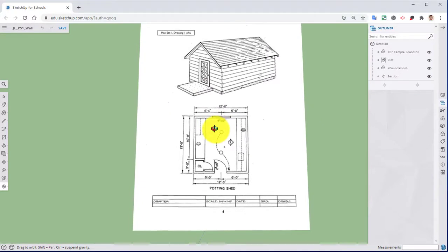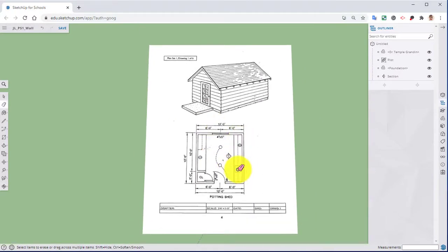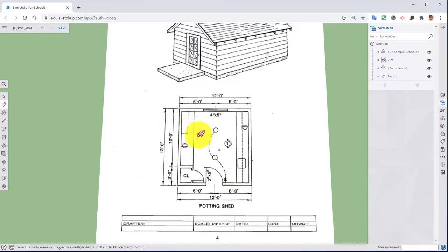This is drawing 1 of our Harley blueprint series, and this is what we are actually going to be drawing. So this is what it will look like. This is the overall layout for the walls. The overall width is 12 feet. The length is 13 feet. We have a small little closet, and then we have cabinets on both the right side and left side. This little one here means that we have a call out for that right side. So it means on one of the other drawings in this little six drawing pack is an image showing how that right side looks.